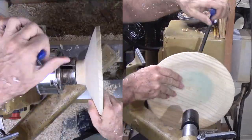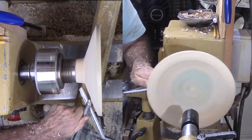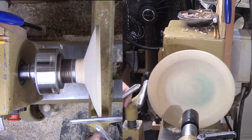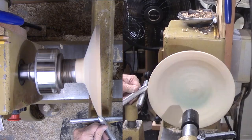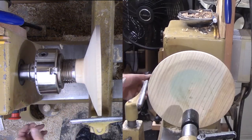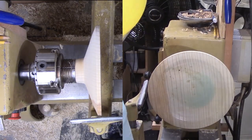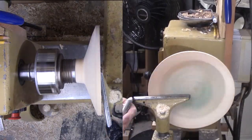Now the reversal. To start with, I am doing just a little more shear cutting to compensate for the expected excess shift. Next, the perimeter at the rim — I have decided to keep the corners sharp and not round them over. After checking to ensure I have cut into wood again for the entire perimeter and not leaving spots with the sealer, I can move on to the interior. The interior hollow is shallow, the wood is cutting beautifully, and it does not take much to re-cut the hollow. I confirm uniform wall thickness by measuring, then I can thoroughly sand the platter.